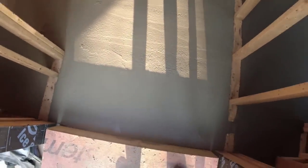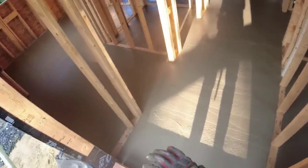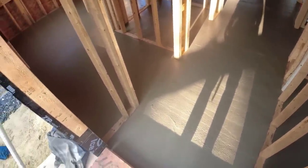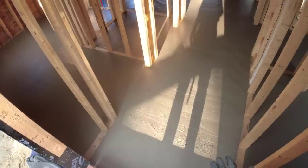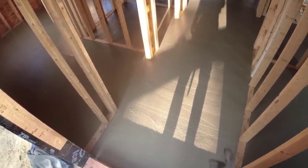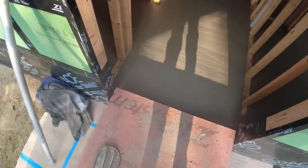We'll float that, and that's going to do it — an inch and a half floor over radiant. The concrete's there just to hold the heat from the radiant, and then they're going to tile, or they might put some type of wood flooring over part of it, maybe a little carpet — but it's all getting flooring. The concrete's not really there for strength, it's just there for heat — that's how we do it. We've done hundreds of these this way over the years, they all work great. Let me know if you've got any questions down in the comments and I'll try to answer them the best I can.